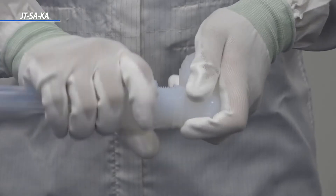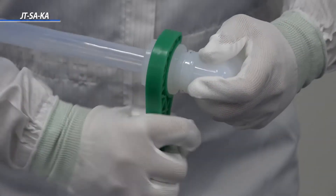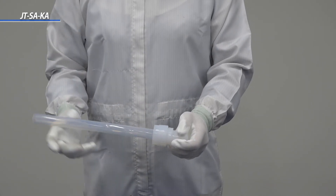The tube with an inserted sleeve can be assembled into the fitting and the union nut tightened. Tighten the union nut by hand as much as possible before tightening it with a correct size wrench until an audible click is heard from the gauge ring on the fitting. The sound indicates that the union nut is sufficiently tightened.